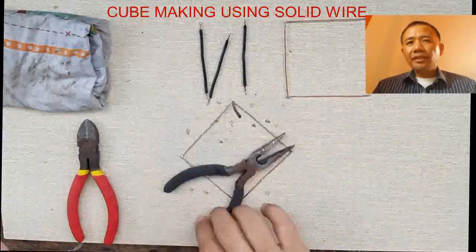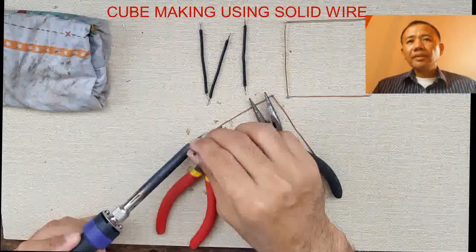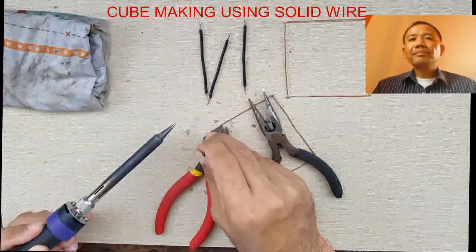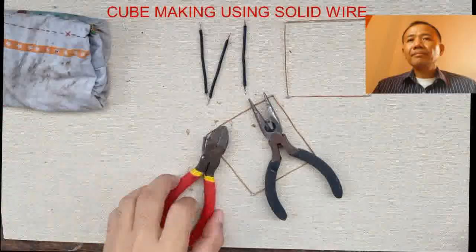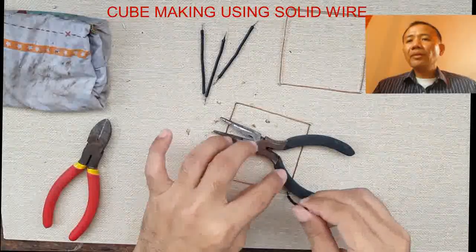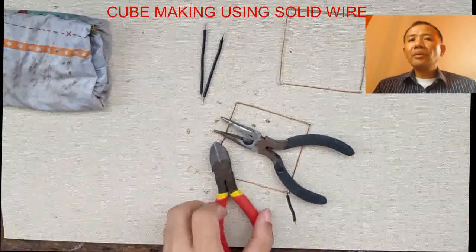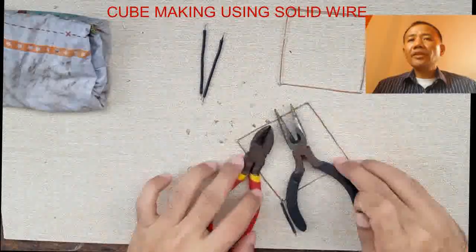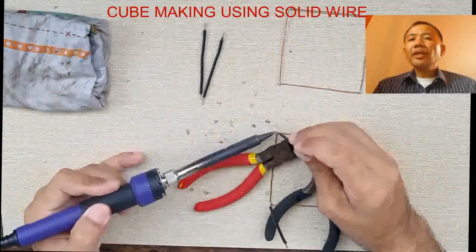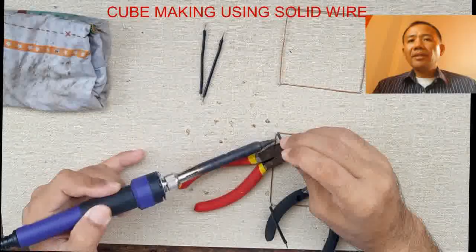For the wires not to move, we put something on top of it. The connection is made easy when the wires are pre-soldered. Now the second stand — make sure that our wires are connected. We wear our mask while we are doing the soldering, and the safest place for our soldering iron is on its holder or on the soldering stand. From time to time we can unplug our soldering iron if we think that it is very hot already.